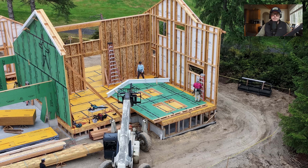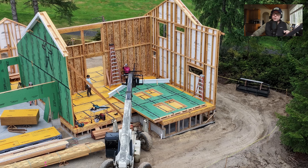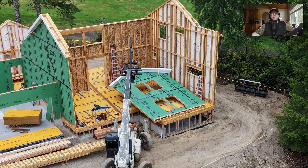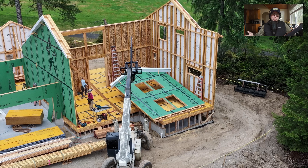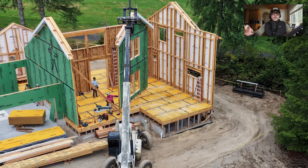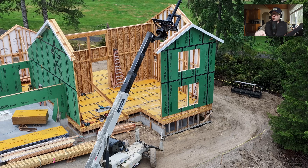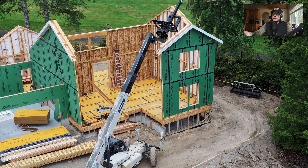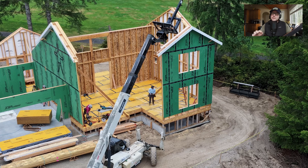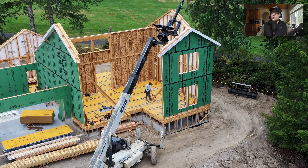It's really easy for us — we have the equipment — to try to eliminate working at heights. So all of those overhangs, the sheathing on the second floor, the gable — this is purely a safety reason why we're doing it. We do get the added benefits of the strength, and that's why I was being a little cocky earlier. It's not because we're better — this house just lends itself to the balloon framing. Now I'm showing you this time-lapse of the front gable wall so you can see how the wall goes in, but I'm going to show you in more detail with POV footage what our order of operations are when we get the wall set. You're going to see we got some things right, and some things almost right, but we had fun the whole time.